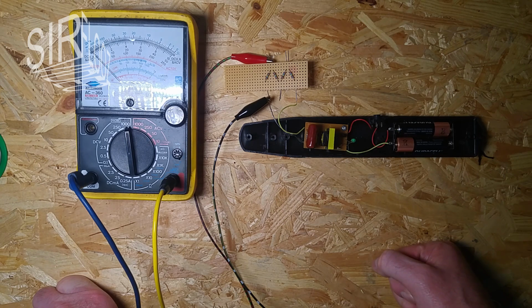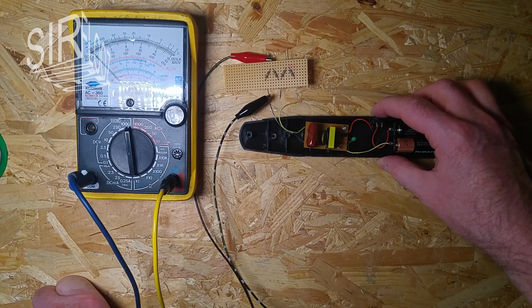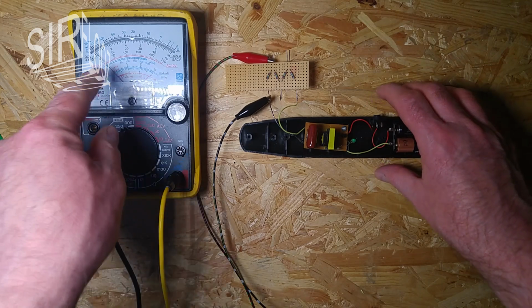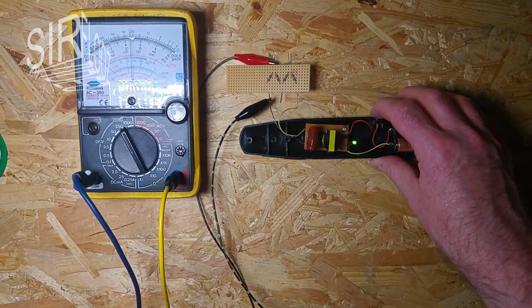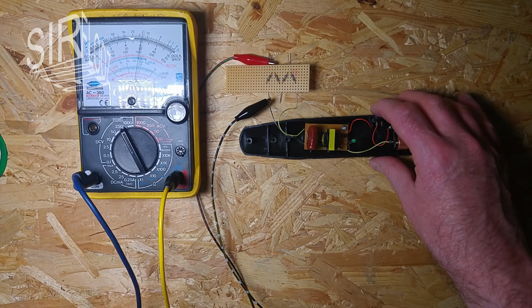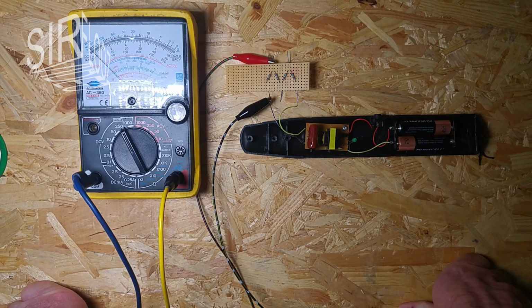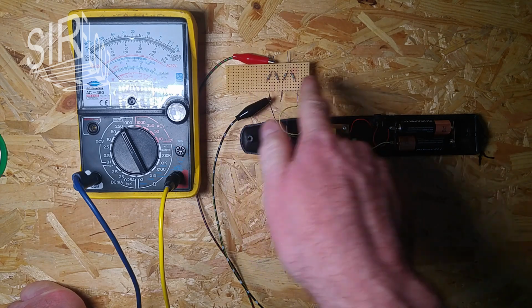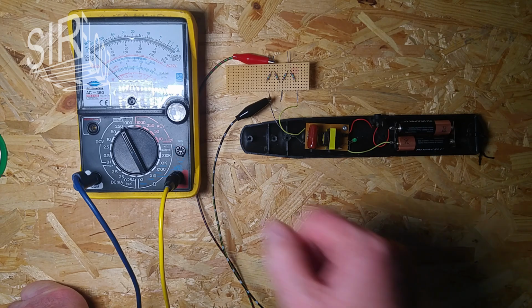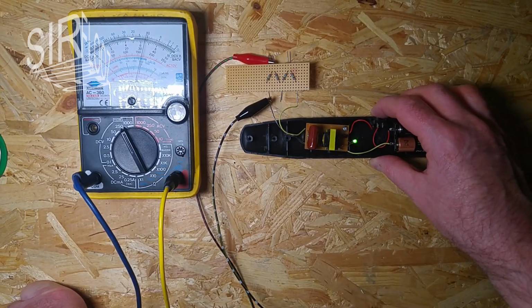And let's repeat that, see if it's repeatable. Yeah, seems to be steady. Maybe I can just go one range lower. Then we have 250 max, then it's this range here. Okay, that's more precise. That's 200 volts. And if this is true, it's 800 volts across all resistors here, which comes from the high voltage generator. That's a difference now. Let's see if it's repeatable.